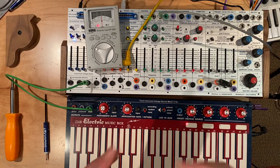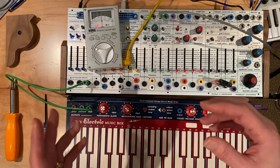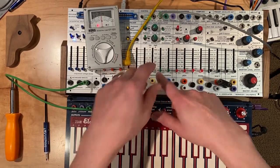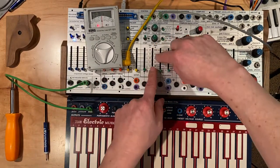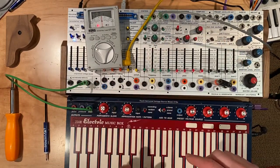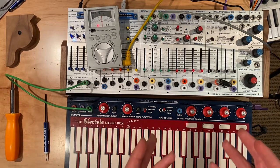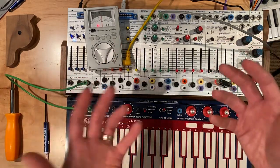They're very touchy trims to get right, so it can be off a little bit. The bottom is about 33 hertz and the top is about 2.8 kilohertz, and the rest of it usually tracks about what it says on the panel. So to tune an oscillator, besides using the fader positions, you use the fine-tune pot.